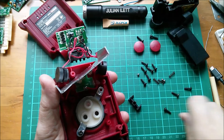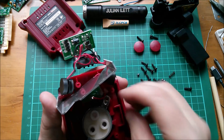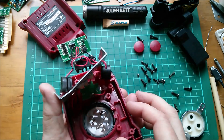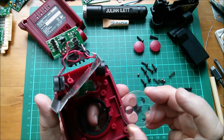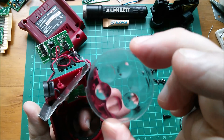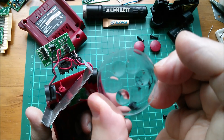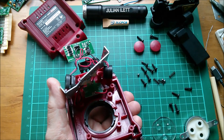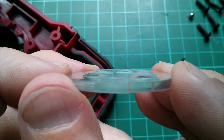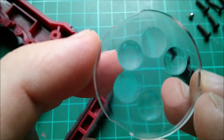While I'm in here I might as well remove the two screws holding the lens arrangement. I do like this lens system - it needs to go back in the correct orientation with the top of the triangle pointing to the on/off switch. Here's the lens disc with three detents - one bigger than the other two. You can see the six lenses: three with more convexity for the narrow beam and three weaker lenses for wide angle. Isn't that fun - it's pretty much how Top of the Pops did that effect.